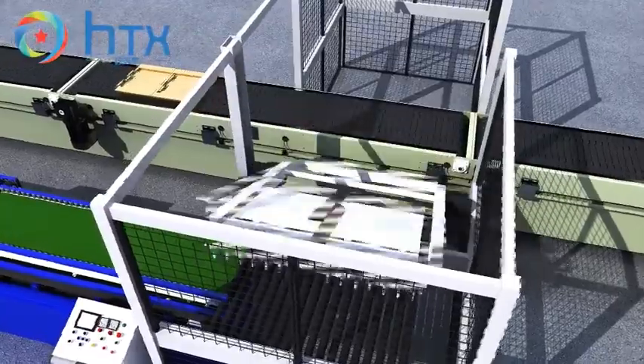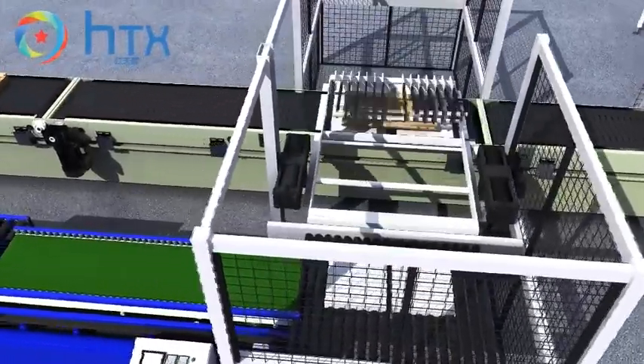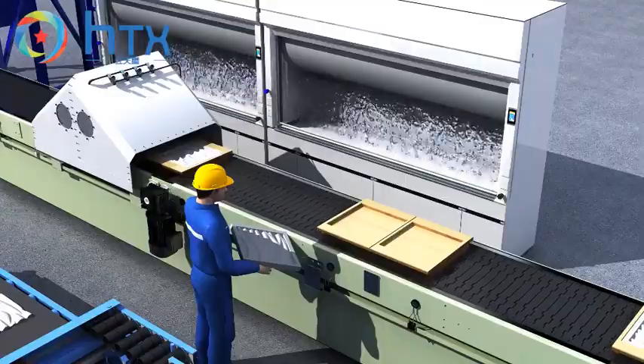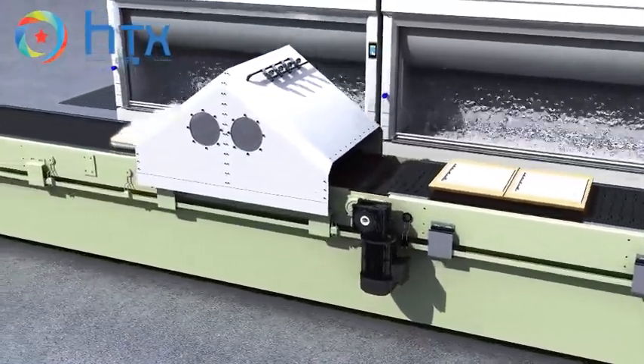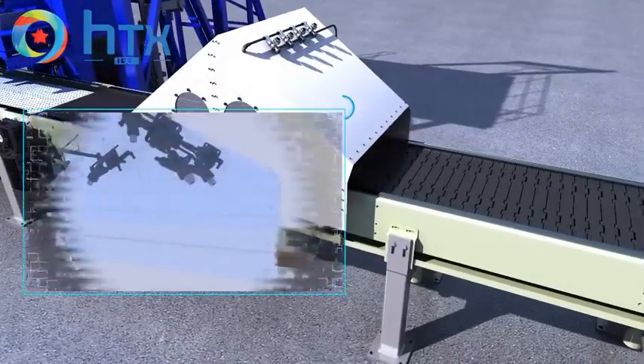The turning machine will clamp the wooden pallet back to the main production line belt and move to the next mold position, doing the cycle for mold releasing. Remove the released molds to the empty position and paint the release oil on the holes. The dust and water recycling machine sucks the extra flue gas away for recycling purposes, reducing harm to the laborers' health.